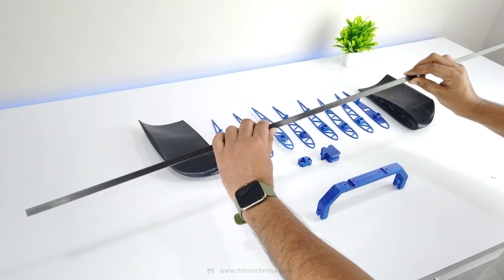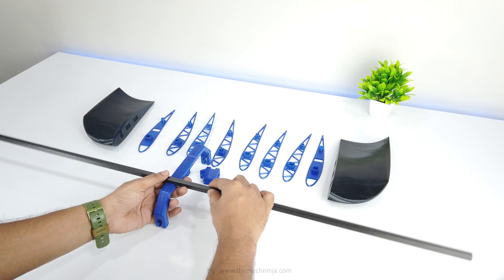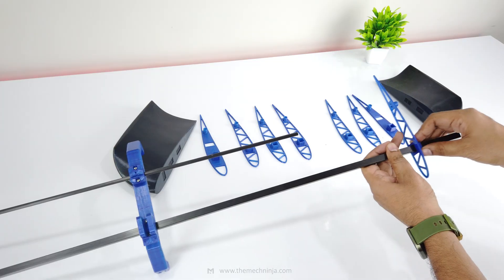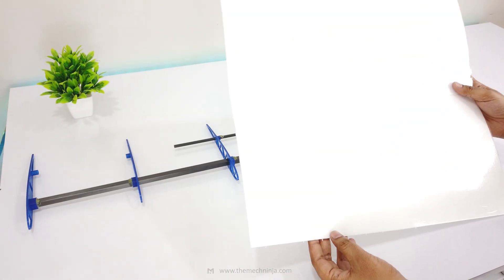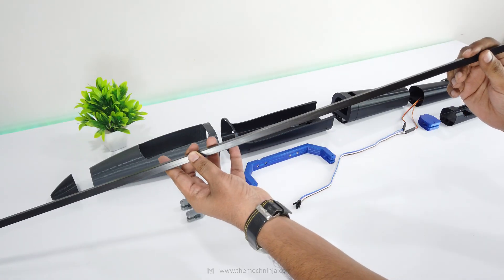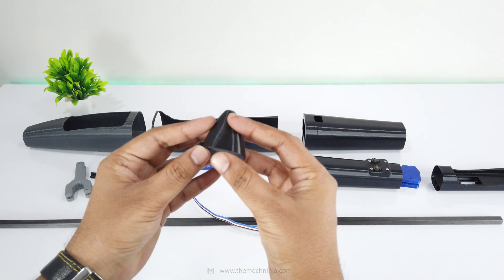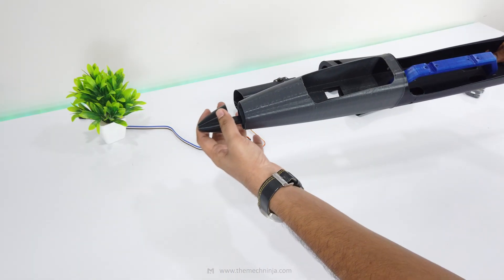Here are the printed parts. The wings are mounted using 10x10mm carbon fiber tubes connected to the center mount with M2.5 screws. An 8mm tube provides extra reinforcement. The wings slide onto the frame and are fixed using glue stick. For the outer skin, I am using a 3mm depron sheet — just wrap and glue. The fuselage assembly starts with another 10x10mm tube. The nose cone is printed in TPU to absorb impact.